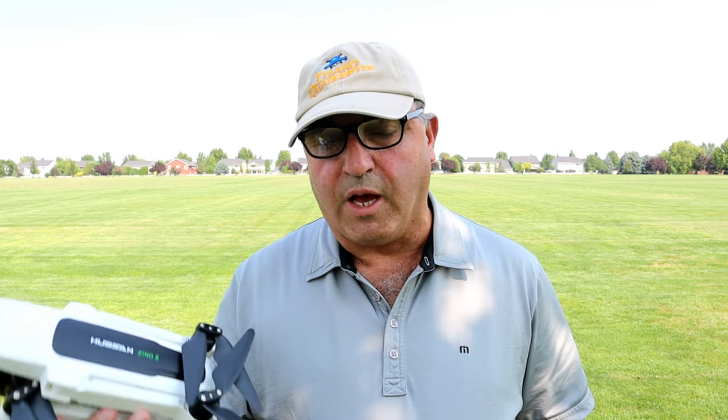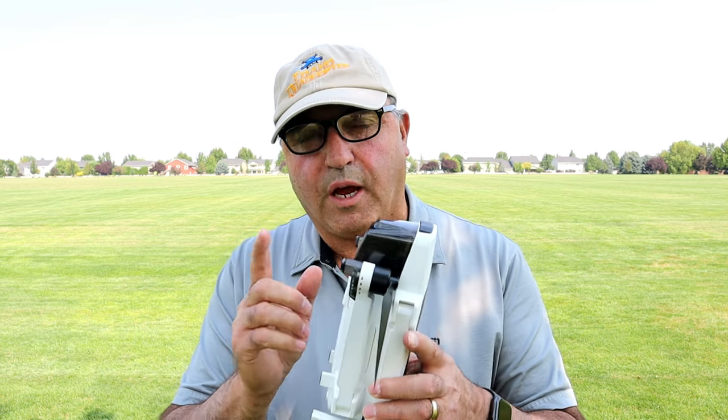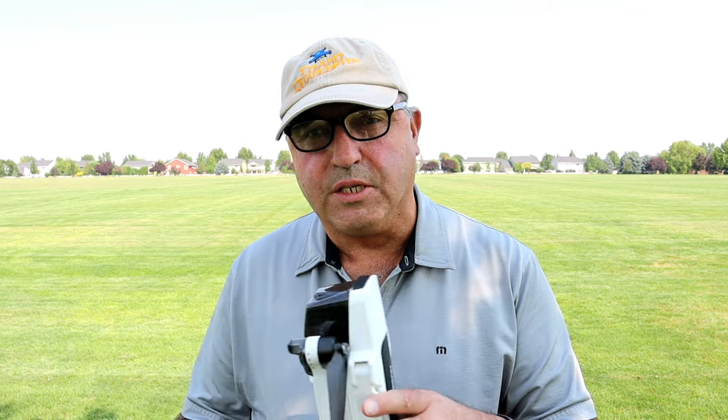Return to home worked. As soon as it got close enough, I canceled return to home and did a manual landing, recycled it, and tried again — actually several times. Every time I would start video, take off, and then we'd lose FPV shortly thereafter. What I was afraid of is that I had the dreaded ribbon cable issue with the gimbal on these things. A number of early build ones — people have had problems with the ribbon cable and had to replace it to get FPV back again.